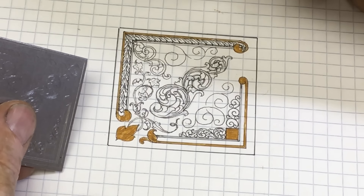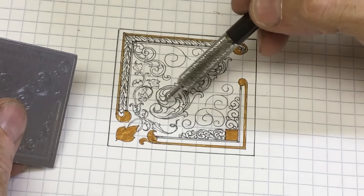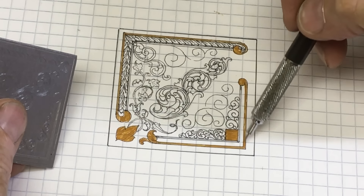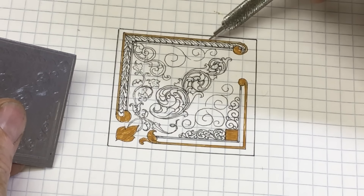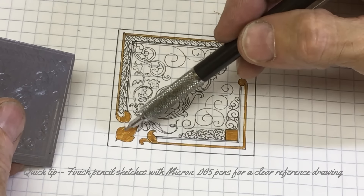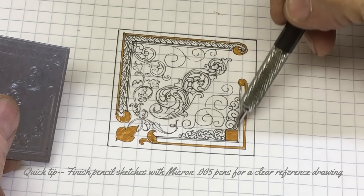Here's our mild steel practice plate and here's what we've got scribed on it. In the center we've got a section of three scrolls, and we're going to use that to show off pneumatic engraving. In a second episode we're going to show hammer and chisel and hand push. From there we're going to move on to some gold borders — I've got basically four sides so I can show off four different techniques for setting in gold line border. We've also got a large gold leaf to show a gold overlay.